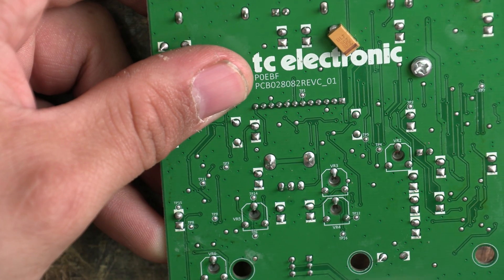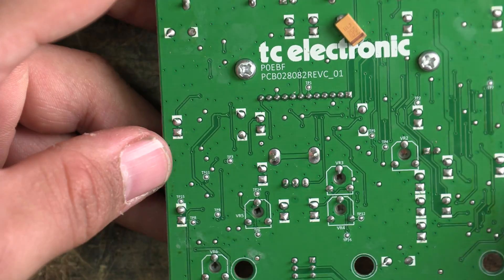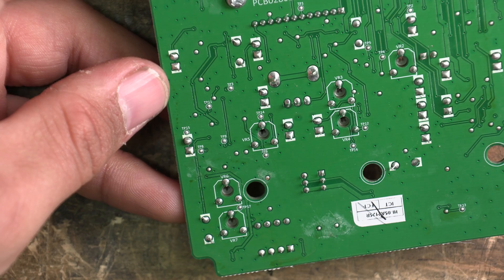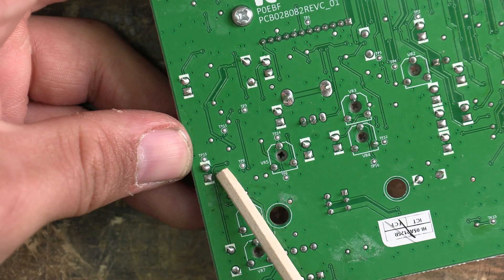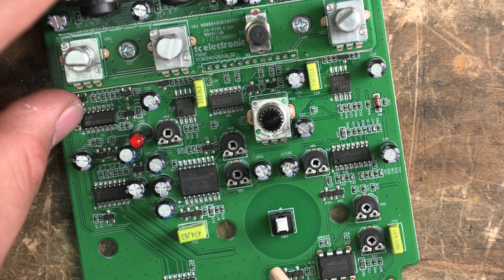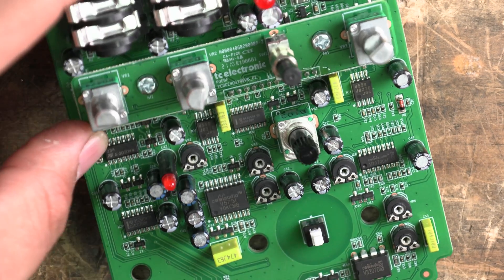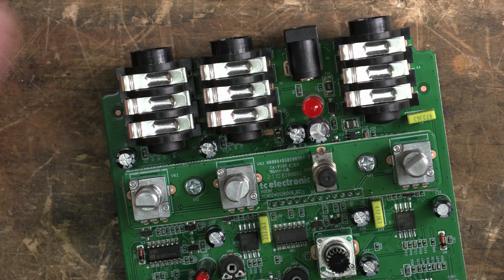There's a little bit of guck on the board, but what can you expect at this price point? They've kind of cut corners in the right places. TC Electronic has made some really good quality budget-friendly effects, especially since they redid the pricing. My main concern is that ball of solder mentioned earlier. The bypass switch is there — I'm not seeing any relays, so I'd hazard a guess it's using ICs for bypass, making it buffered bypass, which I like when implemented correctly. Mono input, stereo output. Let's hear what it sounds like.